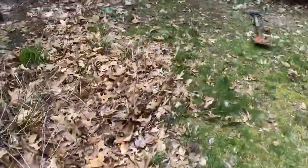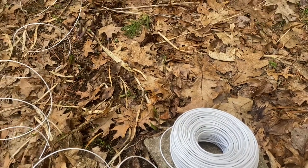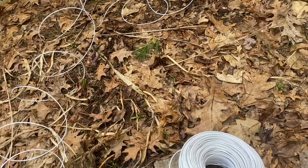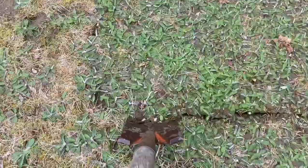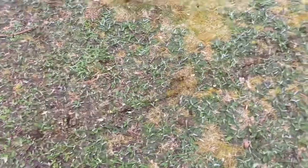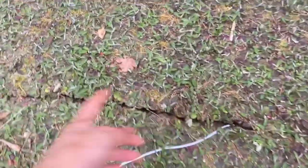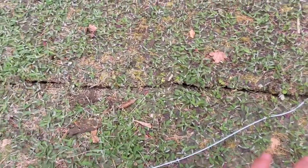So what I have to do is dig a channel in the grass and then go all the way to this window where I run my cable. I've started running my cable — this is 22-4 cable. I would use real fire alarm cable, but because this is going to be buried and just serving as a communication line, I think this is a decent cable and it was also really cheap. I'm basically digging a little channel for the cable to pass through, running it under the channel, and then stomping the grass — well, mostly weeds — back down. It's basically natural conduit, Earth's conduit if you will.